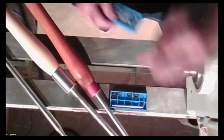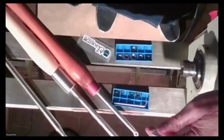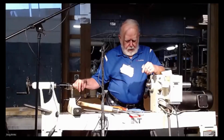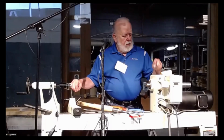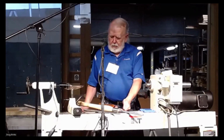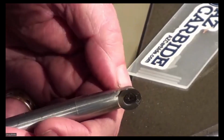Now there's also a 15 millimeter square, which is this. It also fits. Now we were trying to get this done in a fairly short period of time. We were going to add a diamond, but it was going to be an engineering nightmare. So we skipped that. There's roughly 8 cutters that will fit my bar. Now, there's a problem with the square, and really the design of this. See how this is a smaller bar. See how thick and flat it is here? Now we did take the heel off so you can ride the bevel. We're following the same 30 degrees throughout.